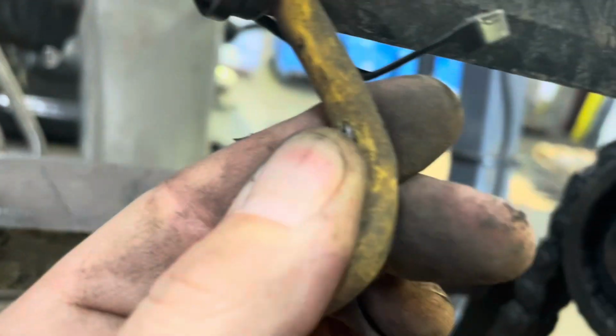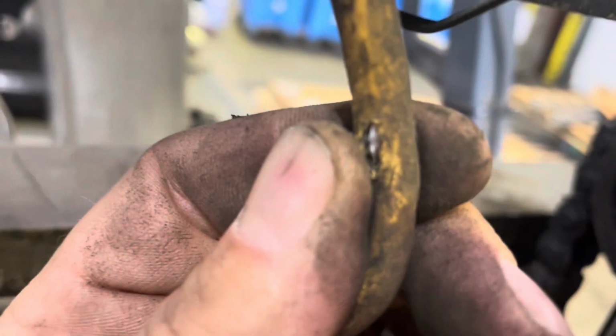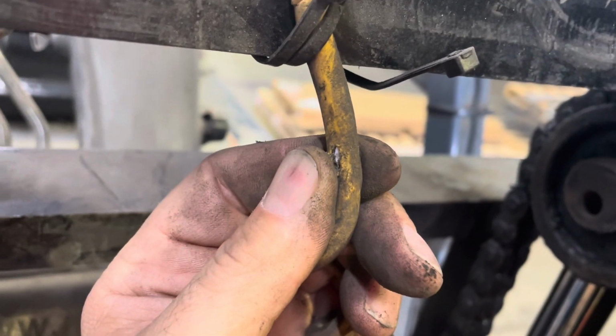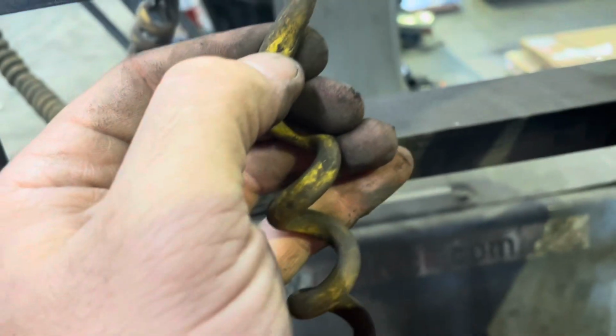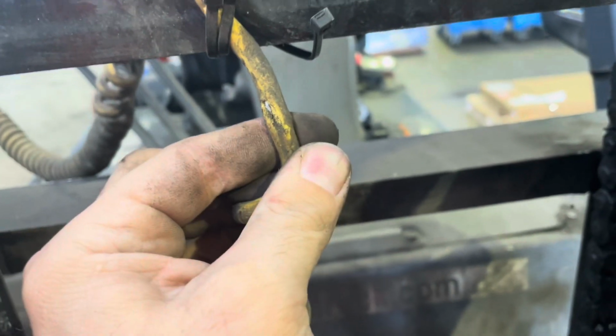I'm checking the load cells physically now instead of electronically. I don't see anything. I did find some cuts and tears and some repairs on the indicator wire. And I'm looking to see if there's any major damage. I don't see anything really, really bad. I did find, and you'll see it later in the video, where it looked like there was some major damage. It may have been repaired. I don't know because I didn't open it up, but there was some electrical wire wrapped around.